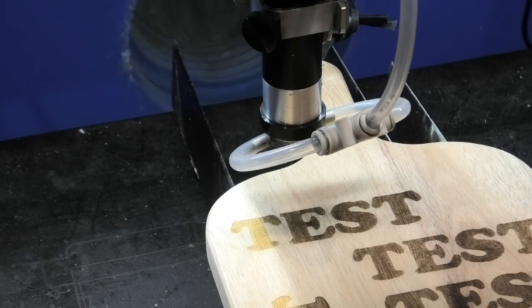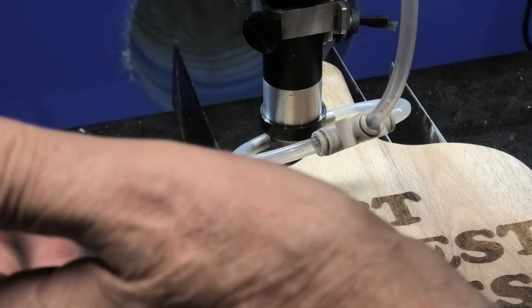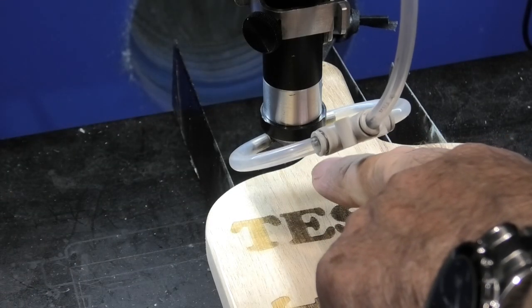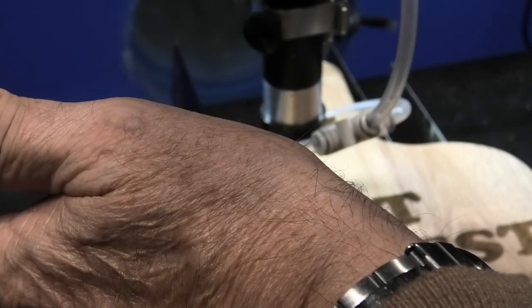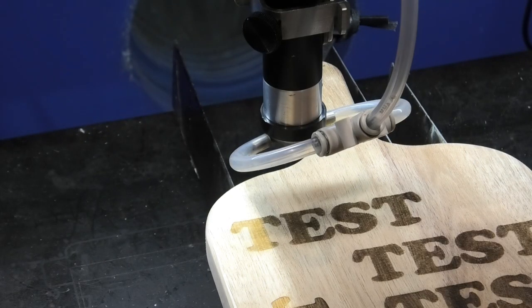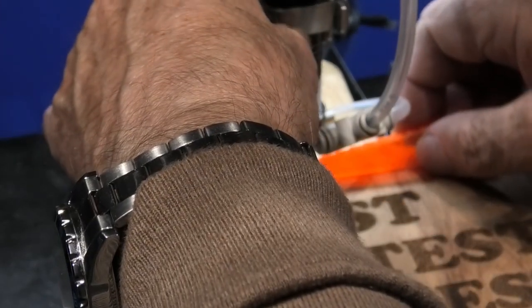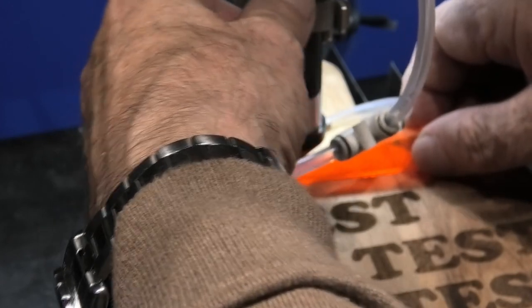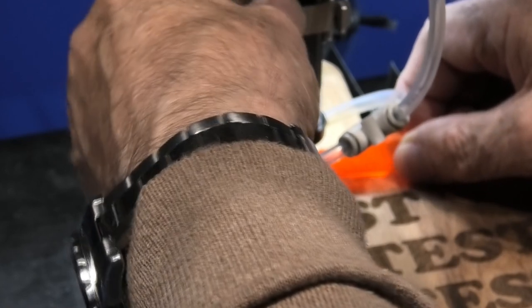First of all, you could go to the opposite extreme and get a slightly darker burn and a more uniform burn if you use a compound lens, which is specifically used for photo engraving. This is designed to produce 0.1 dots, and it's great for doing this sort of work. The focal length is 21 millimeters, so it needs to be set approximately 11 millimeters up from the work, because there's 10 millimeters inside the nozzle.